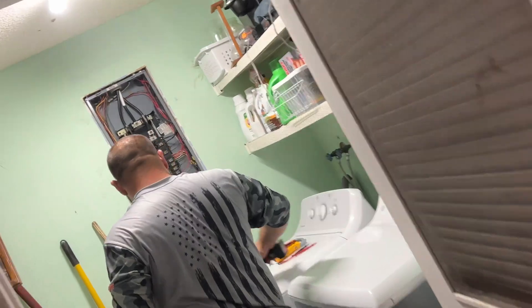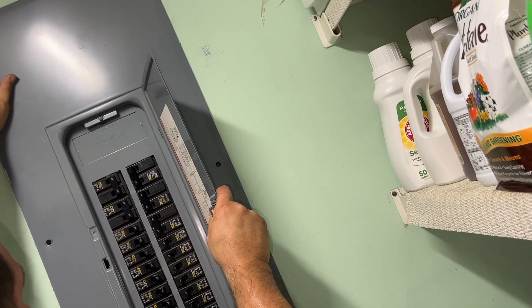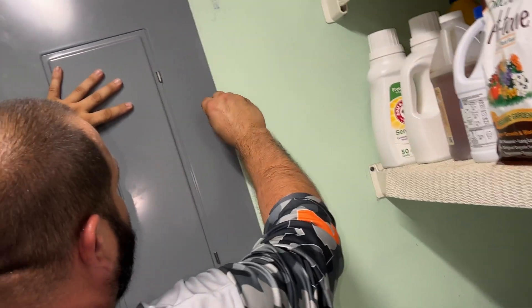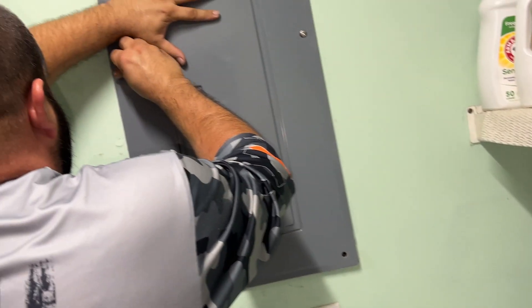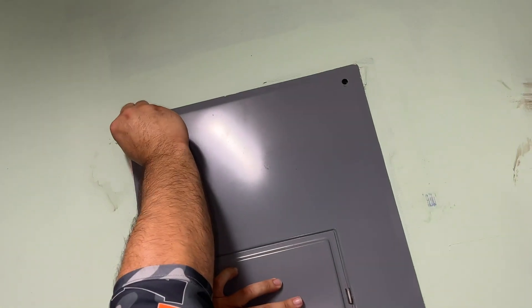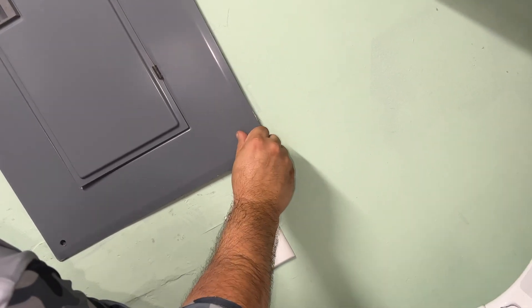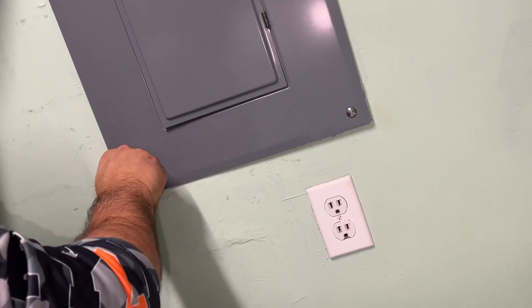Let's go see what we've got. Shall we check it? All right, so we're good? Everything's on? We've got the panel right here. Woo-hoo! We'll put the screws back in — and Bob's your uncle. Excellent job, Pat. Way to diagnose that. I would have never thought to look at that breaker — I would have had the condenser taken apart, taken the whole unit up. That's why that meter right there is your best friend. So first thing: check your breaker, check your power. Go around and check the power in everything.